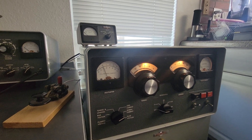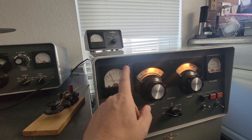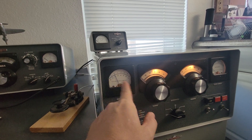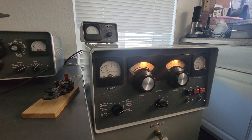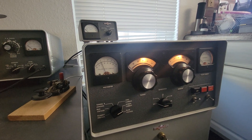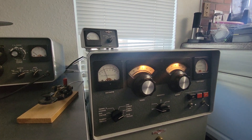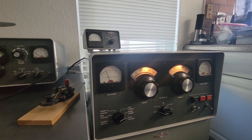You will find that if you get this out of resonance, the screen current will whack over or suck all the way the other way, and it will take the tube out in very, very short order. If you get too much plate current, it'll trip — and you hope that happens before you fry the screen or hurt the grid of the tube and have it short.